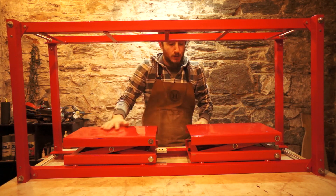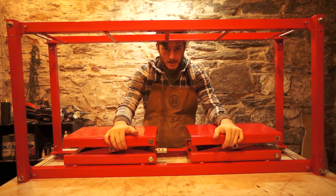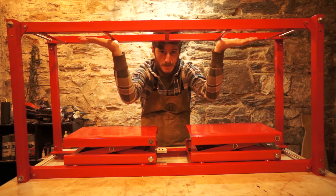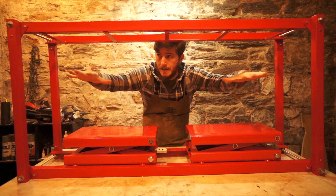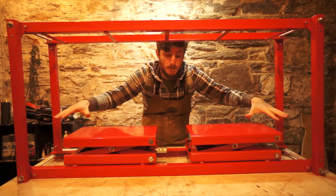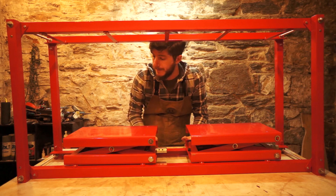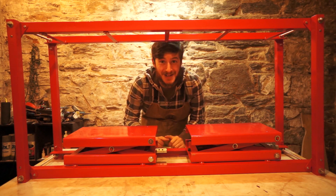The next thing I want to do is make sure that all of that force is distributed evenly. I'm going to make a platform for the jacks to rest on, a platform to go on top of the jacks, and a platform to suspend from the top of the frame. That will give me a nice big surface area over which the force of these jacks will be distributed, meaning we'll get more even pressure within the mold and we'll be less likely to have delamination. That's going to be the next video — really excited with how this is going.